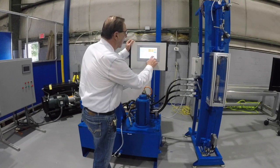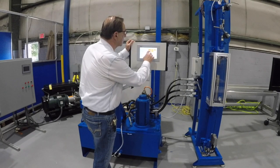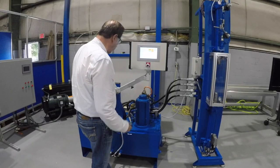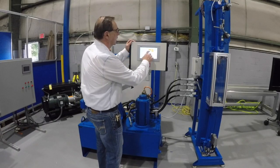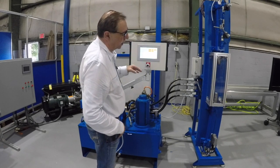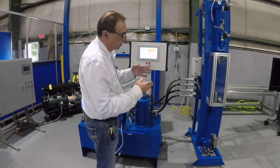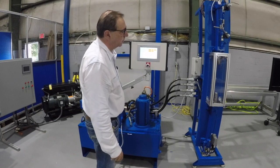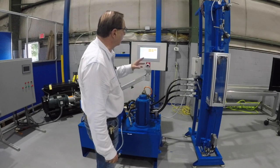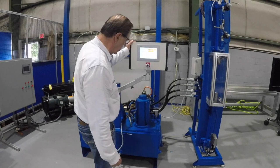I'm going to bring it back to 0.5 inches. You can see that the motor sped up to make the move. So that's manual mode — what this shows is we can accurately position the cylinder. I'm not doing any force control, I'm just positioning the cylinder to where I want it to be. I can set the force, the position, the speed, and the accel and decel of the system.